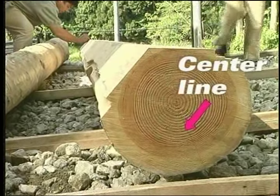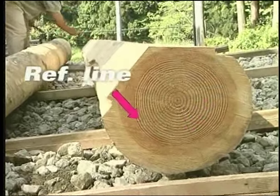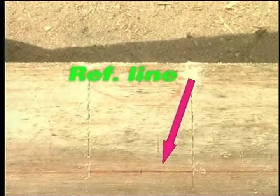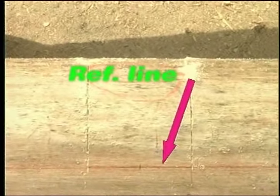Place lines and do the slope cuts. Then roll the log onto its side so that you can snap lines vertically down the length of the ridge for the reference height line. Turn the ridge log over so that the peak is down, then snap a center line on the bottom of the log. Use the plumb lines on the ends to ensure a vertical position.